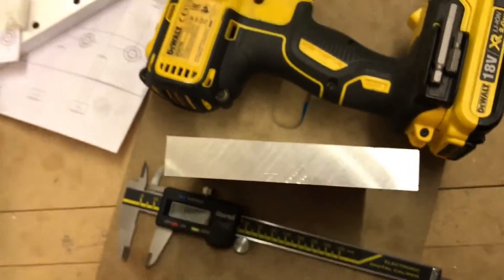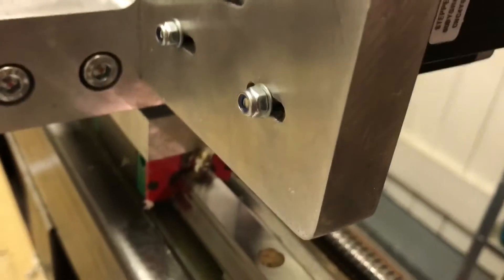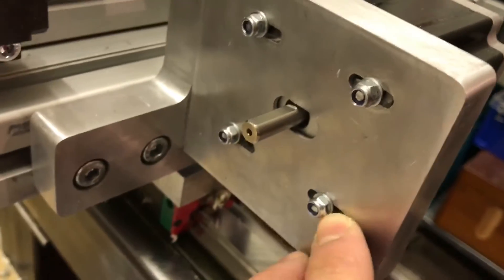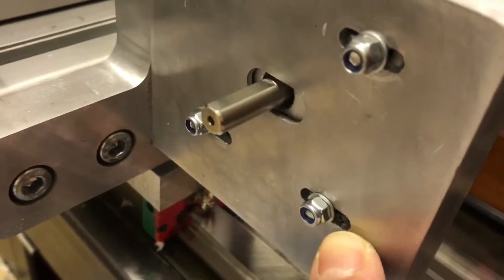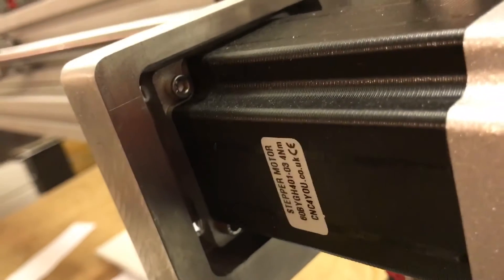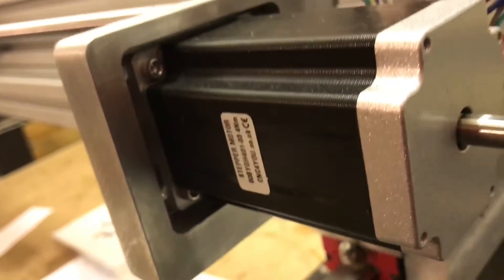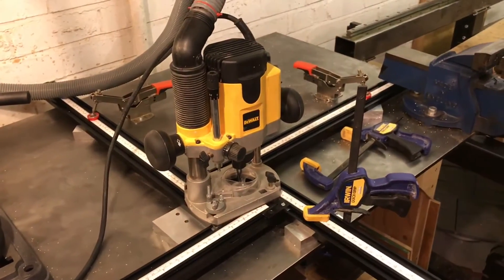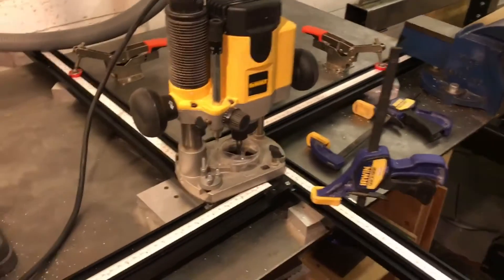The way I've done it on this one — where the bolts are, that's 4mm of aluminium left, and here is only 2mm of aluminium left, and I've cut out a pocket in the back. Now this is the kind of operation that's dead easy if you've got a mill or a CNC machine, but I don't have one of those yet, so this is my setup for doing pocketing in a slightly more garage fashion.